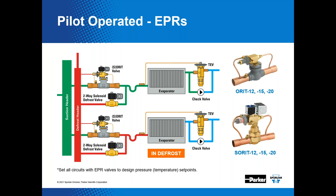In this slide, one evaporator is depicted in a defrost cycle. The solenoid valve at the liquid line would be closed, allowing hot gas to enter and pass through the evaporator. A check valve is included so that hot gas doesn't have to flow backwards through the pressure drop of the thermostatic expansion valve. Instead, the return goes around the TEV and through the check valve back to the liquid side of the system.